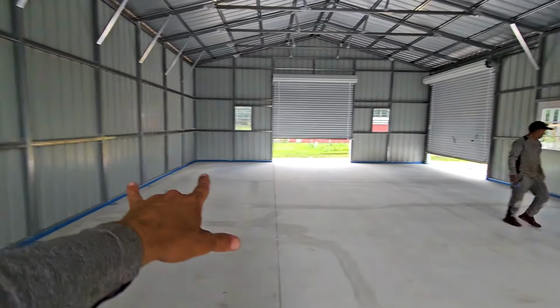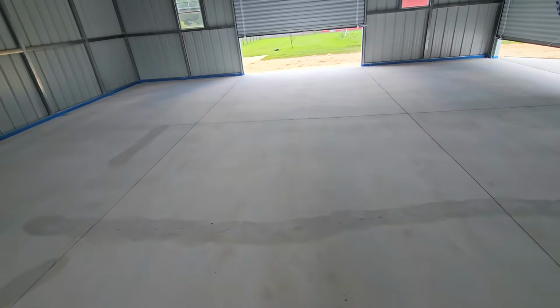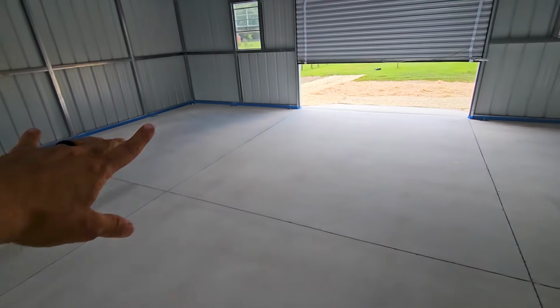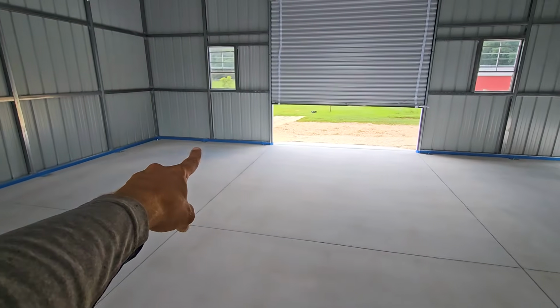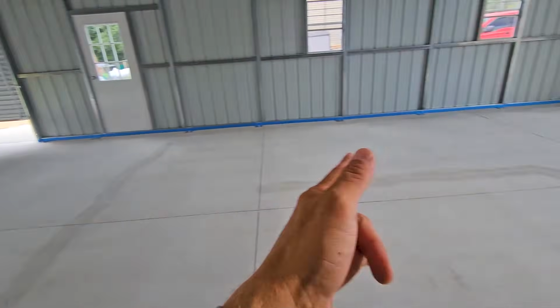So I'm going to squeegee it out, jump over these joints. They opted to not fill the joints, which is the correct solution. You don't want to fill these joints. They're designed to expand and contract. So I'm just going to puddle jump. Going to pour ribbons out, squeegee it across the floor, and back roll the primer all the way across the floor.